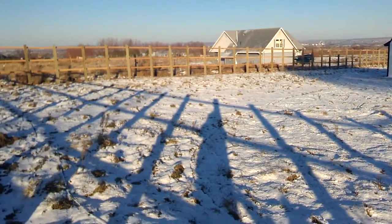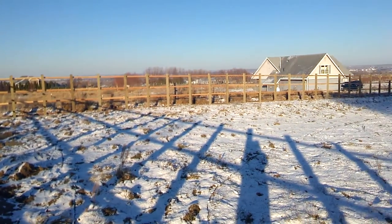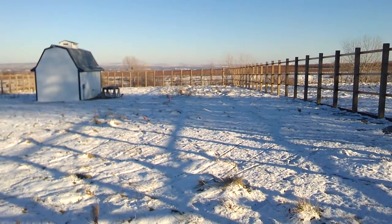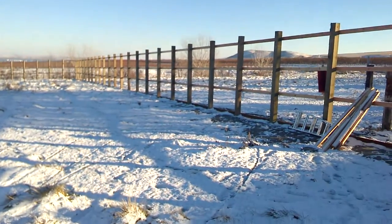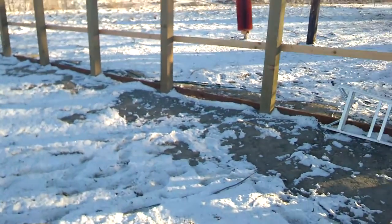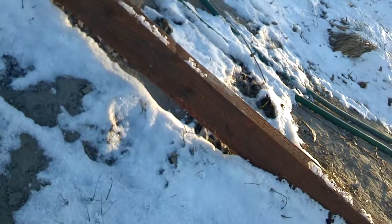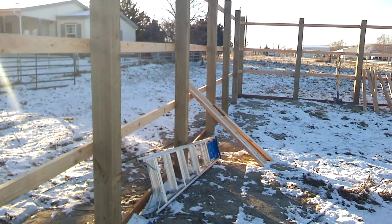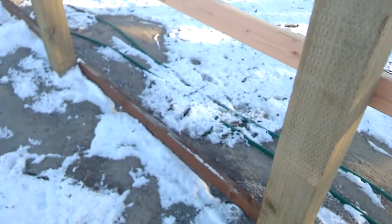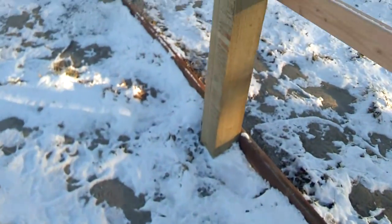As you can see, there's a little bit of a bend in it over here, where the earth starts out level and then starts to angle down. That's just a minor imperfection in the fence. But once we got over to these, we just started going with the lay of the posts as opposed to the lay of the land, and it came out pretty good. There's some high spots and some low spots, so instead of digging, we really went from 12 inches up on that end to 12 inches up in the middle and on that end. The board just followed the string, which gave us a nice straight bottom board with gaps in some spots and low points in other spots.